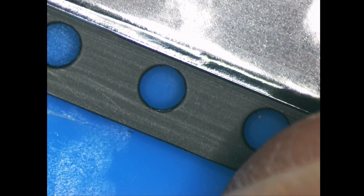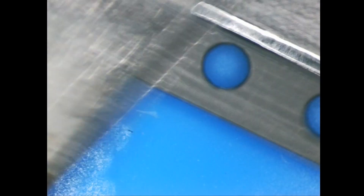You can see these ones are a little bit squarer than the other ones. Very compact in here where I'm working. You can see there's a wide side and a narrow side on the board — this is the anode and that's the cathode. If you turn it over, the white part is on that side. You can see the anode on the side — there's a little notch here which is the anode. That's a good clue for orientation.